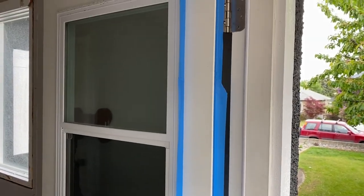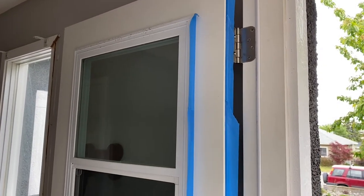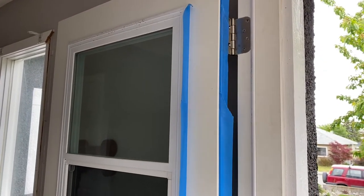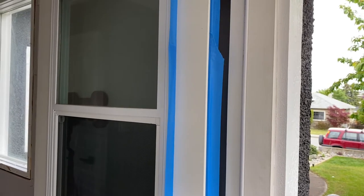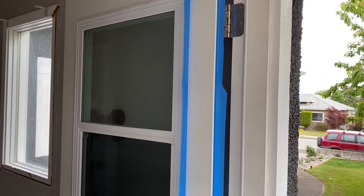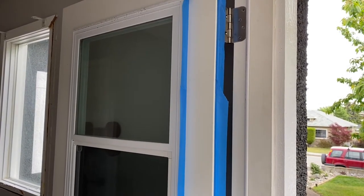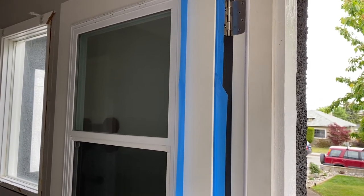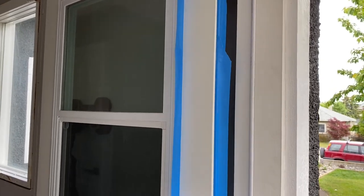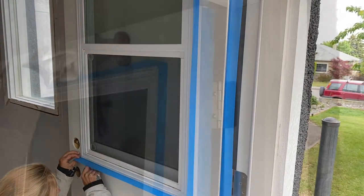The window — I don't always recommend taping, but on this metal door we're able to shove the whiz roller with the microfiber sleeve right up against the edge to limit brush strokes. We'll have brush strokes on the right side but not the left, and we'll try to roll out as much as possible to make it as smooth as possible on the entire door. Not every door has this middle window so you don't often have to tape in the middle. It is important to have a really crisp line with the taping so that you're fully painting the entire door, especially with a color change.